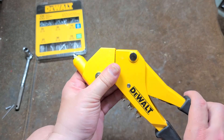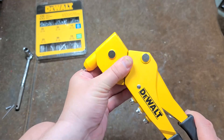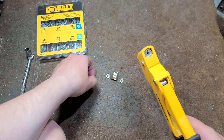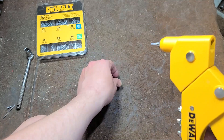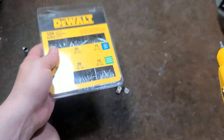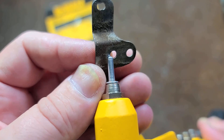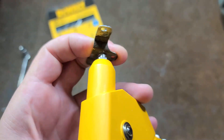So if you need tight spaces, you can flip it around or orient it straight in, flush, or even sideways. When rivets are described as eighth inch, that means you want an eighth inch hole, because the rivets don't have much expansion — you really need a hole that's just the right size. Put it in there and give it a squeeze.